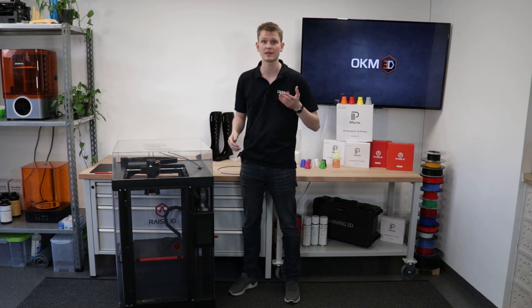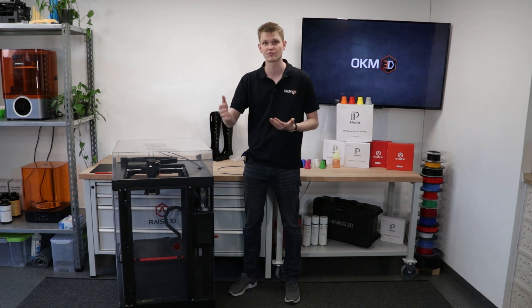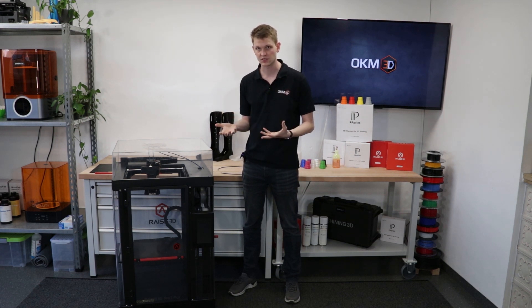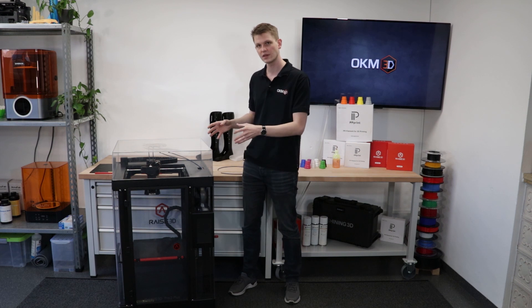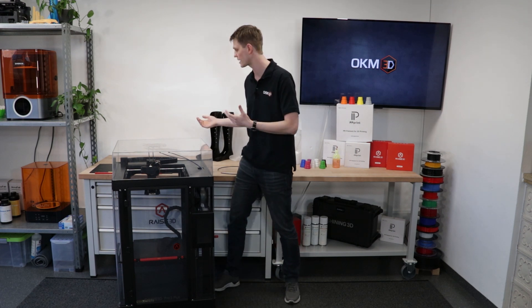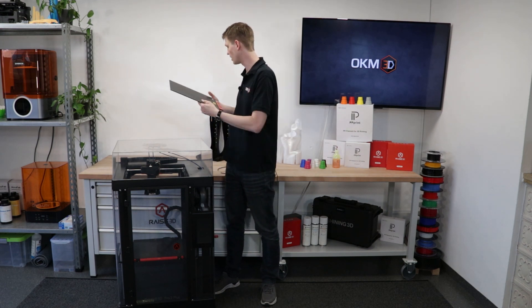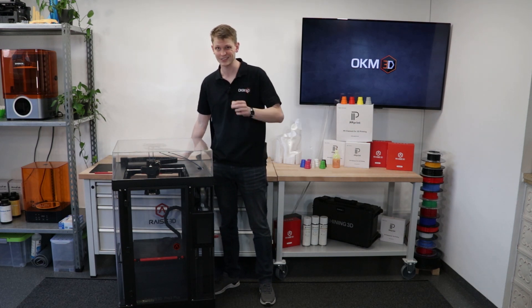But polypropylene is traditionally fairly difficult to print. Not only is the material somewhat difficult, you need a support material. And traditionally for polypropylene, you use breakaway supports, meaning that you have quite a lot of work afterwards to get rid of all that extra support. On top of that, the polypropylene generally doesn't stick very well to existing build plates — whether you're using glass, a BuildTak surface like the Pro 2 traditionally uses, or MT Plus or something else.